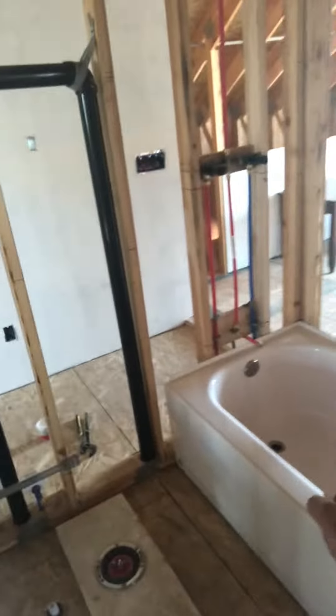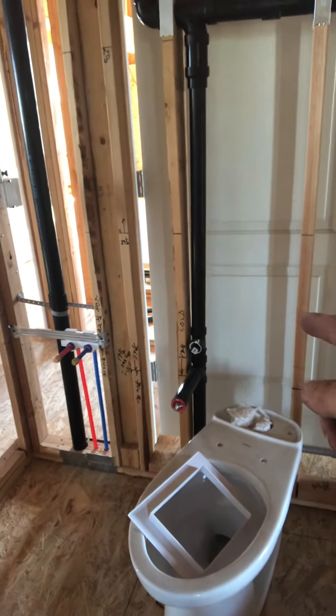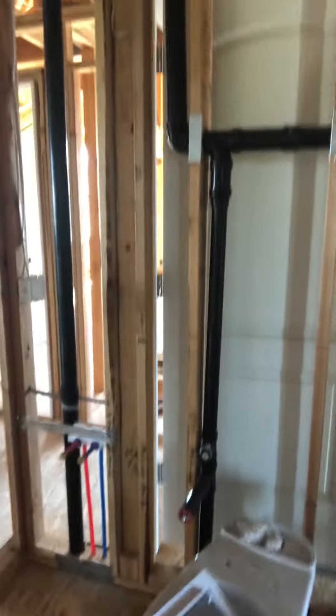Let's go top side to see the bathroom and the tub. So there's a drain pipe underneath the tub with an associated vent, a toilet with an associated vent, and there'll be a vanity with a clean out above the drain — not below — with water supply and associated vents. They all converge up there, and the whole system has been water tested except for this tub.